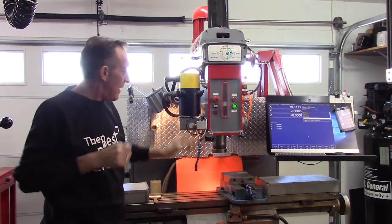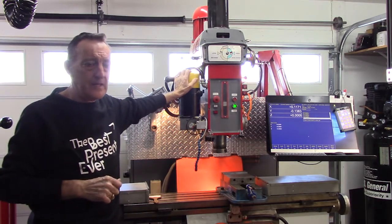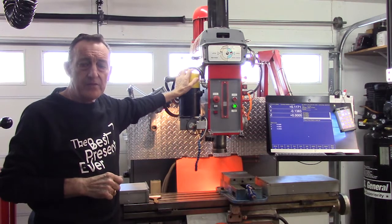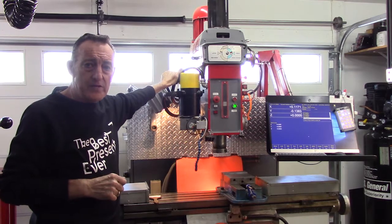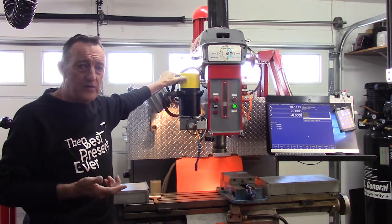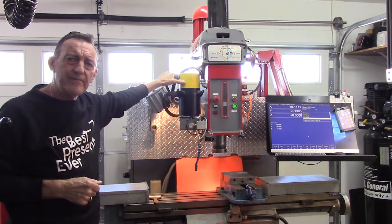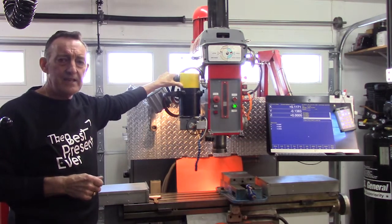They were 2,000 line encoders. Exactly. So that saved you just a little bit of money as well. Yeah, that was great, because once you start buying these servo motors and stuff, they're very expensive. And luckily, this machine has been done for a few years now, and I've had absolutely no trouble with the motors or the encoders. Everything worked out really well. It's an accurate machine, and so yeah, it worked out really good, Marty. So those are considered the Fanuc yellow top DC brush servo motors. Exactly. So you were able to reuse those. That's great.